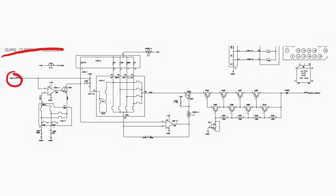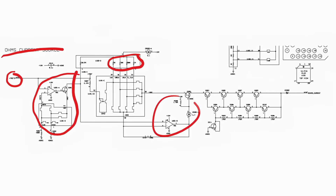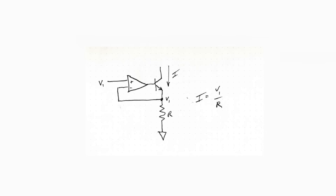When you measure ohms, you force a current and then measure a voltage. This is the part of the meter that forces the current, so you output an exact one milliamp, 100 microamps, or 10 microamps - a specific current - then you measure the voltage and that gives you the resistance. So this circuit has a voltage reference that goes into the main circuit, then some analog switching to select different resistors for the ranges, output circuitry, and some bizarre stuff over here.